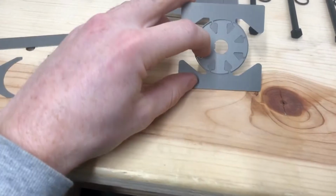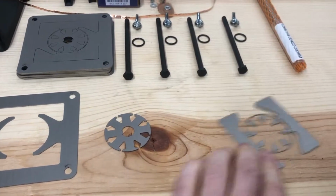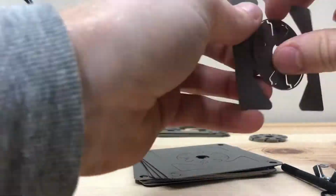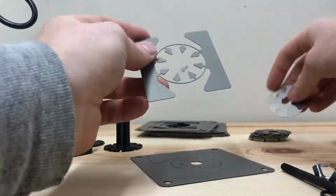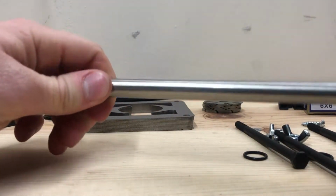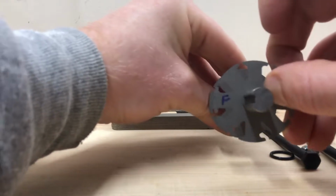Now we're going to punch out the rotor in a similar fashion. Just push it on through. 2 useful parts, the yoke and the rotor, also known as the armature. And this guy is just useless. Put all of our rotor pieces onto the shaft. So I found it easiest that we've got this little key to slide into the key opening in the shaft first, and then that helps you line it up and slide it back in.